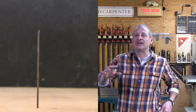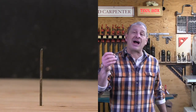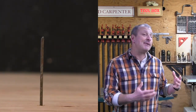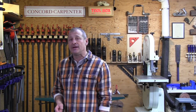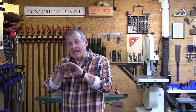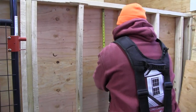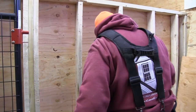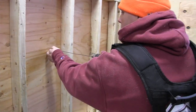Here's what I do. After measuring, laying out, and figuring out my center or whatever I need for my installation, I chuck an insulation support rod into my cordless drill. Using my support hand to hold the rod right around the center of the rod in the drill, I just slowly turn the drill on and send the rod through the plaster, or an attic floor ceiling, or whatever boards. You've got to use care when doing this tip though, guys.